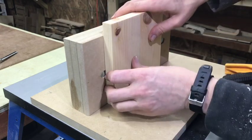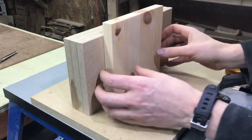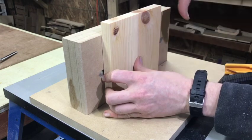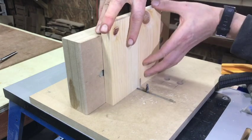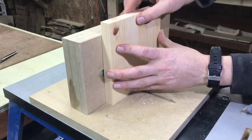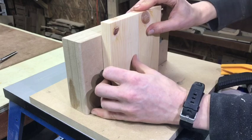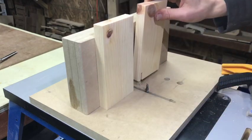And you'll want to put these up there. And you don't want to be ramming these together. They just need to sit nicely so that your gap essentially should roughly disappear here. If you've got a big gap, these are probably not square. A little bit of a gap is not a huge deal, but you don't want to be able to see a lot of daylight through there. That's how we line up our other side.